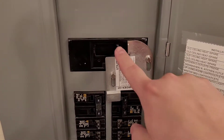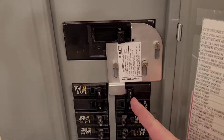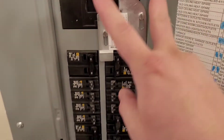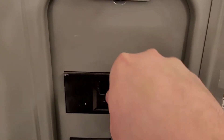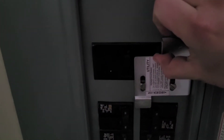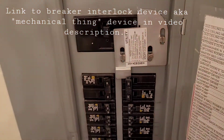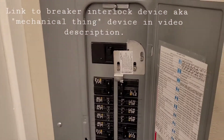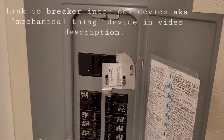My power is not actually out — my lights are on from the utility. Here's where the power would come in from my generator. I can't turn that on and power up the panel until the utility power is off. So I'm going to kill utility power, and then I can lift this mechanical interlock out of the way. Now my house is being powered by my generator and utility power is off.